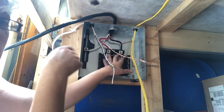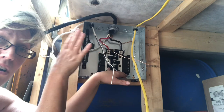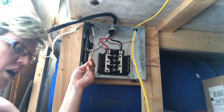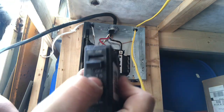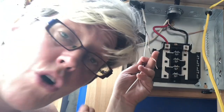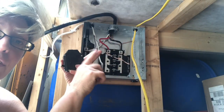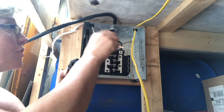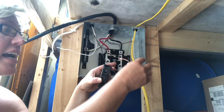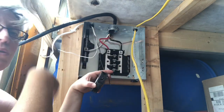None of this is turned on, so I can't get electrocuted. We added that because we've got the four-wire system. This is a 50-amp, 6-3 wire that comes in. Black is hot, red is hot — we have two hots. White is still neutral and copper or green is still ground. This has room for eight breakers. This is simply for shore hookup. So this 14-2 wire hooks up to this 15-amp breaker. I put the hot wire in the breaker, the neutral over here to the neutral bar, and the ground over here to the ground bar.